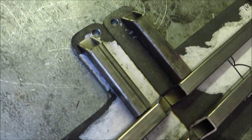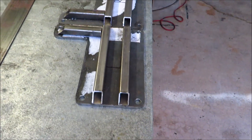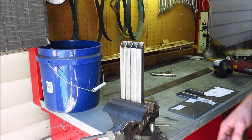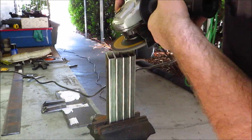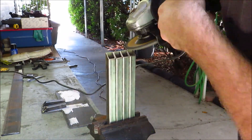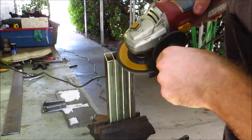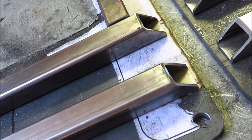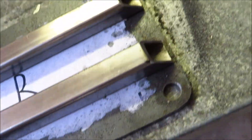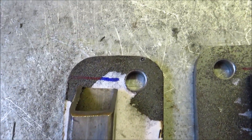So there you have it — that's what it's going to look like. You can see I got those other pieces up there; just imagine the flat piece right there. These braces are going to keep my transmission from breaking, hopefully. After cleaning them up, you can see there's a little bit of a gap between the edge and the angle iron. They're still pretty equal — I didn't grind it perfectly flat, but that's okay. Everything's going to weld up good.